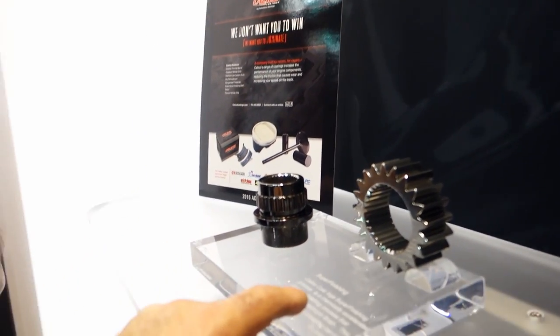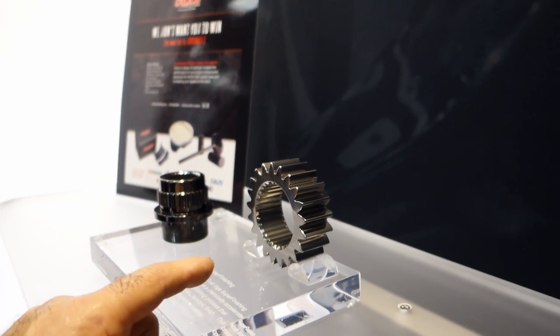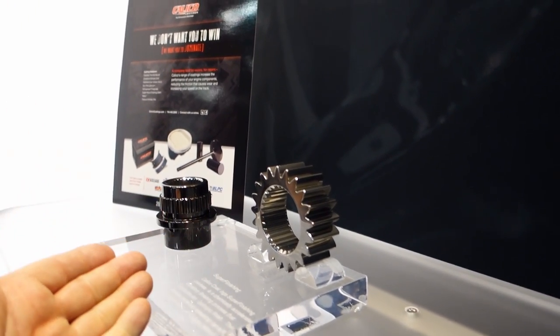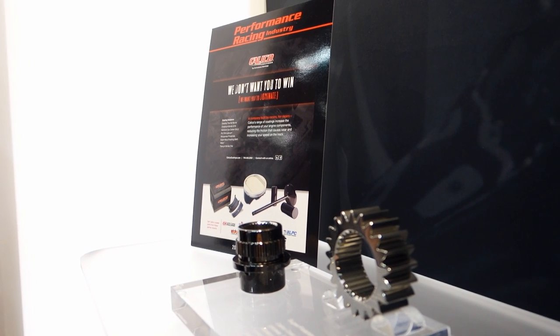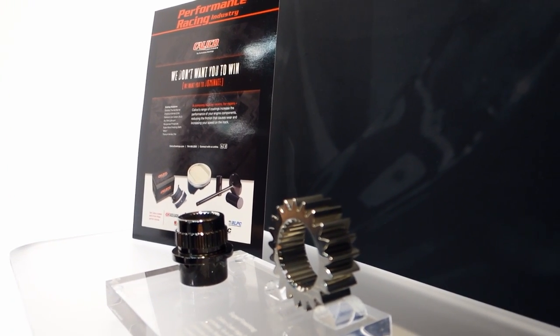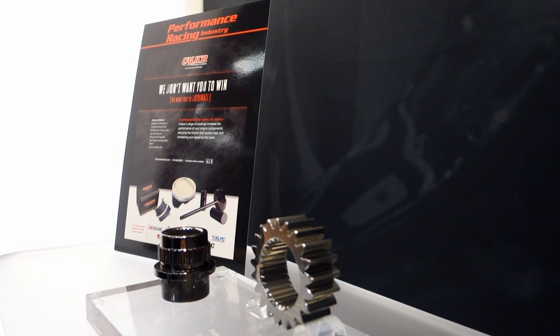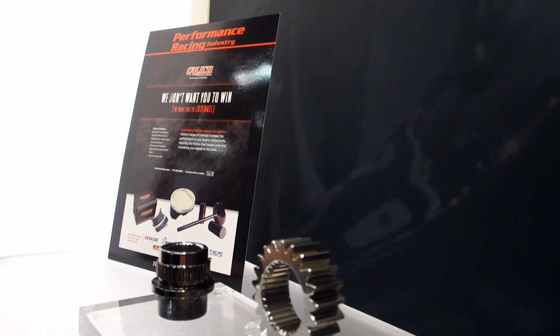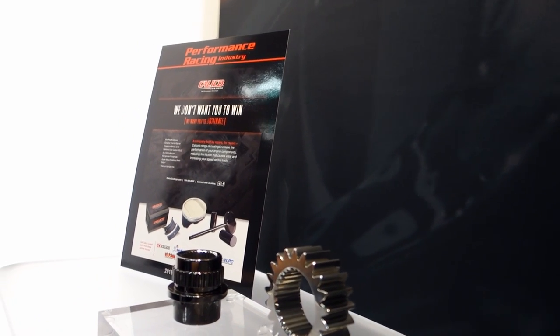Now, I noticed it said over here that it's chemically accelerated. Yes. Okay. Now, there are some people that say it shouldn't be chemically accelerated, they would use water instead. What are the pros and cons of that? Well, the chemical acceleration shortens the cycle time and it gives you a better finish. Obviously it increases your load-bearing surface because everything's much more even, right?